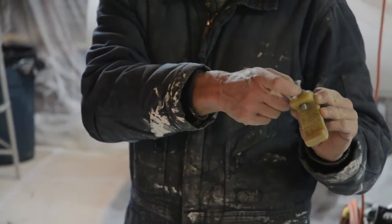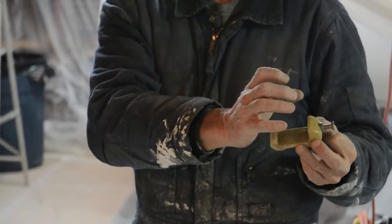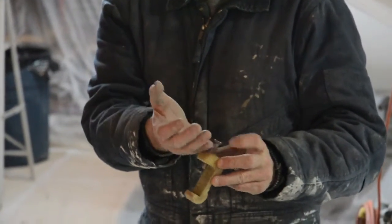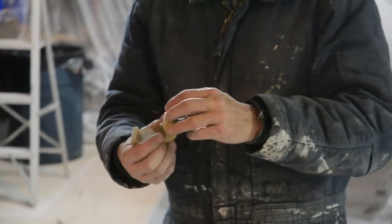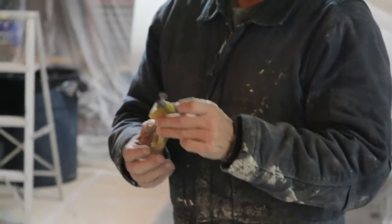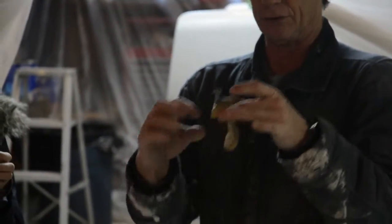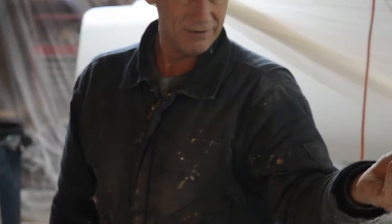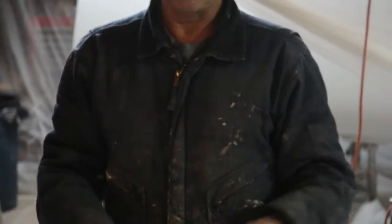And I think I would have liked to see more tooth on the tube. Just sharp, a little more heavier thread? Grit. Yeah, or maybe just carve a couple of grooves in it so that when the epoxy cures, it forms like a little lip. Right. Some sort of give, because you could draw the tube out, the 1/4 20 is strong enough to draw the tube out. Oh. But what I was doing, it was plenty to squish the two pieces together. But, I mean, this tube is beefy as hell, and it's not too damn heavy. Right. Yeah. And it's glass, so it isolates, and it does all kinds of other stuff.